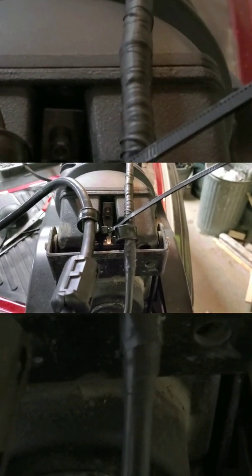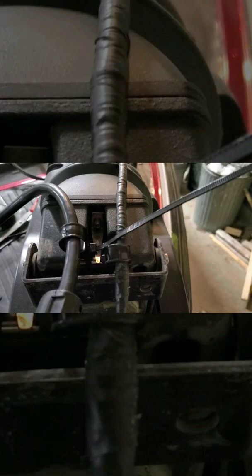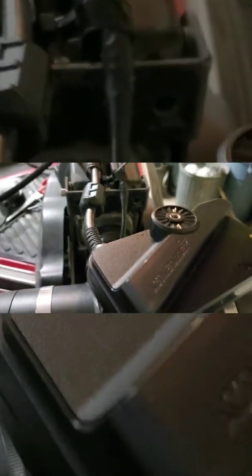All right, so now I have the cable clamp secure on the 3-in-1 transducer cable. And it's also secured around the shaft. All I need to do is trim that tail there. I don't think I'm going to secure it to the base, because since the 3-in-1 is further out from the barrel, it actually aligns almost perfect. So I'm not going to secure it to the base. I'll just put a spring on up there again with tension at the head of the motor.